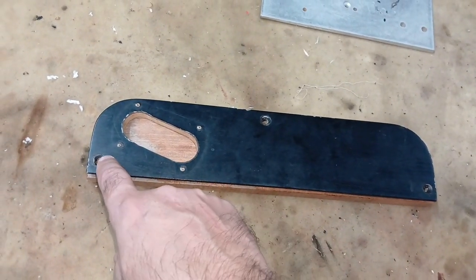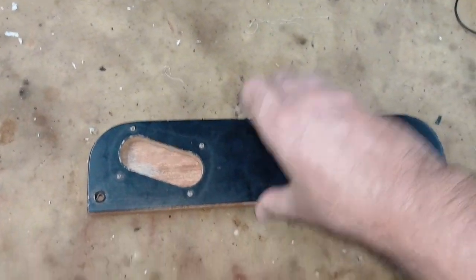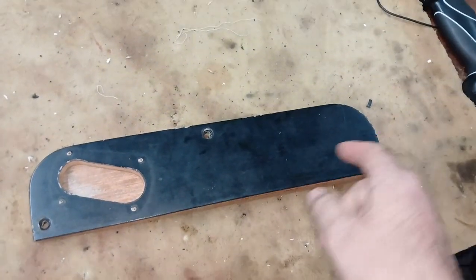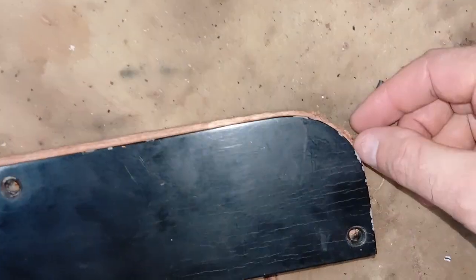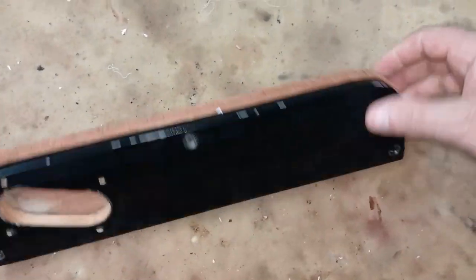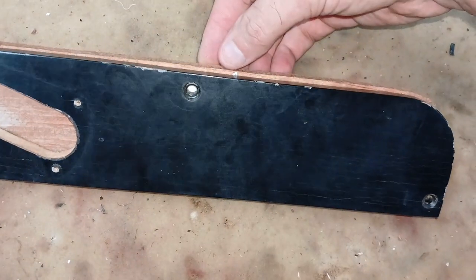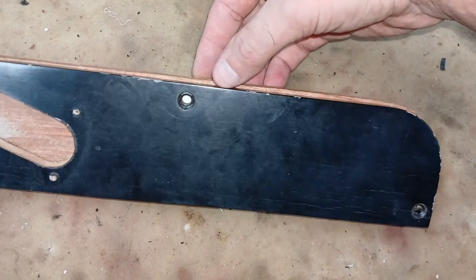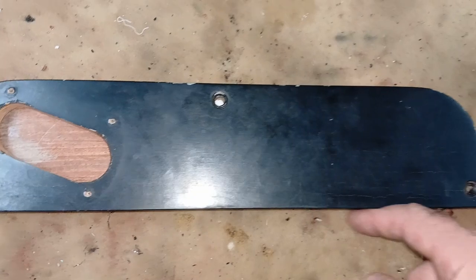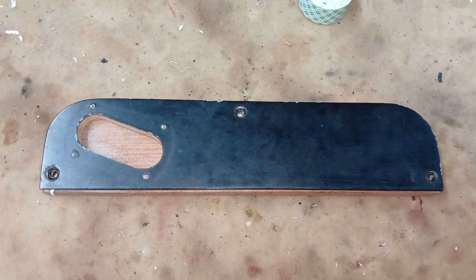But then after that, I could actually put screws in from one to the other, holding them together with that double stick tape and stuff. And I can run the router along them and exactly copy one outline onto the next. Okay, so I've put some double stick tape between the boards. Now, this is a little wider than the black part, but these two, I align them exactly correct, right? So the router will be going along this edge. This is already lined up perfectly.